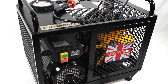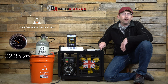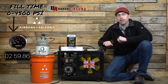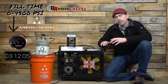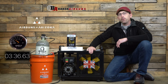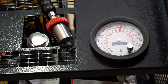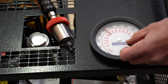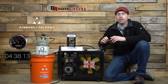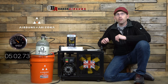So why pick the Daystate Type 2 versus another MCH6 compressor? The Daystate Type 2 comes with a couple of features you're not going to find easily on a regular MCH6 compressor. The first of these is the cage that you see surrounding this. You're spending thousands of dollars on a compressor that is likely to be in your shop, and the last thing you're going to want is to bugger it up by dropping a tool on it. This cage is going to protect your compressor and investment long term. The second reason is the dial-up pressure feature — the gauge — which gives you the ability to easily adjust the automatic shutoff. If you're filling tanks as well as individual air guns, especially at a club, this feature alone can help prevent overfilling your PCP.